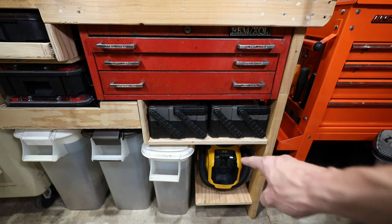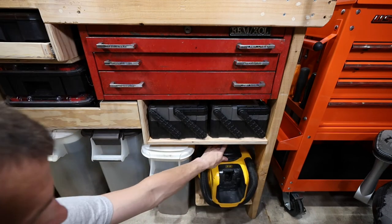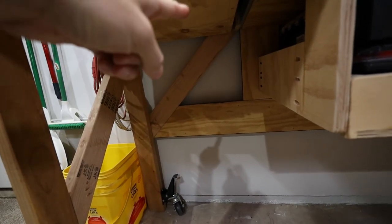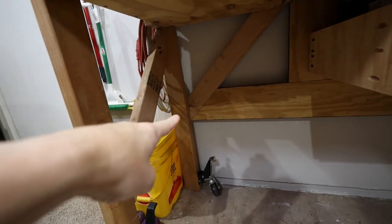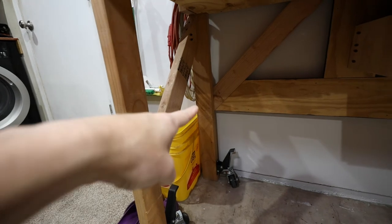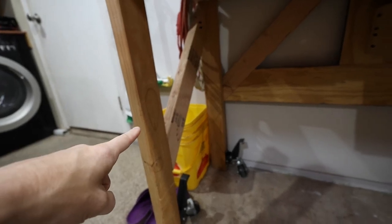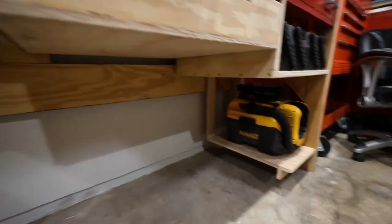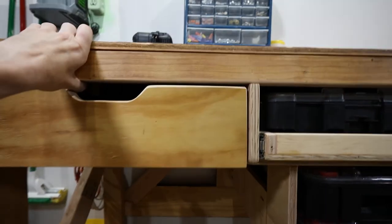On the bottom shelf there, I have my DeWalt wet dry vac. I can just quickly grab that out from underneath, stick a battery in it, and use it — quick and handy. This is how I strengthened the workbench up: I put some supporting cross members to help take the wobble out. The legs were oriented front and back, which caused a lot of wobble. So I twisted the front legs 90 degrees, and that helped a lot, along with some more cross members on the other side. Now it doesn't wobble like it did before — it's quite sturdy.